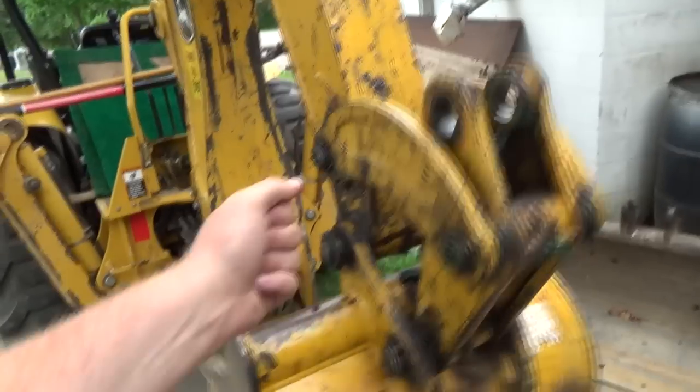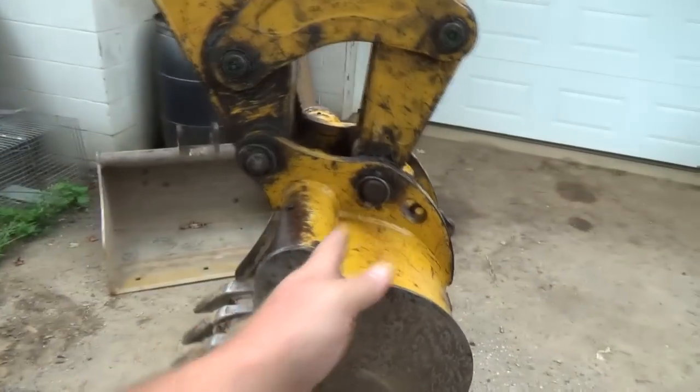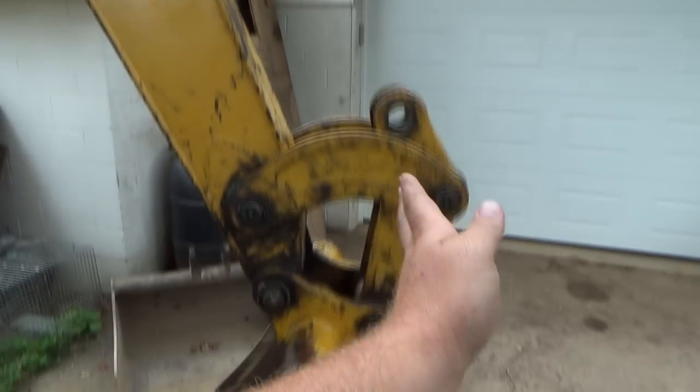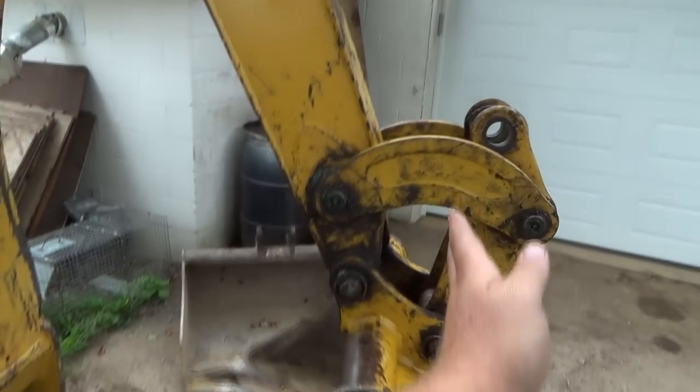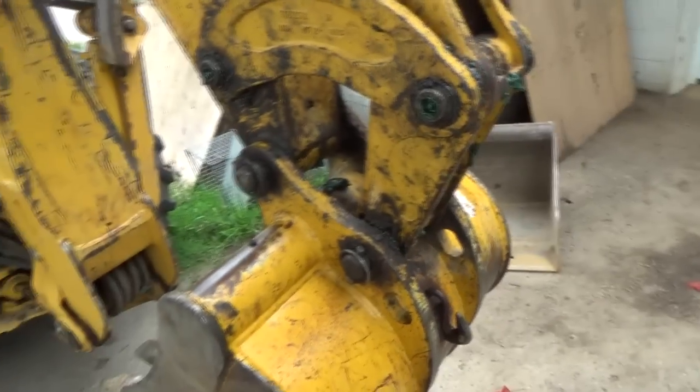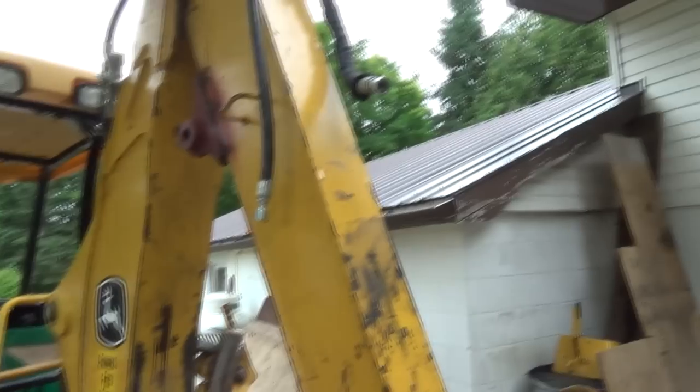And as you can see here, it's doing this too, right? Your cylinder would have to be mounted way out here, so when it curls in, it would just about clear. So now you just have this short little spot here, which I guess you probably lose a little bit of power on, but you just put a bit bigger cylinder on and away you go.